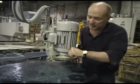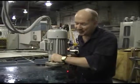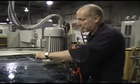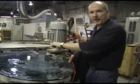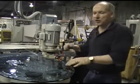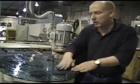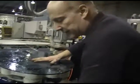And this is the second time around coming up soon. I'm just going to ease off the glass to get a smooth transition right about here. I'm going to just shut my water off, turn my table off, and my spindle. Normally I'll take the suction with a little squeegee to get most of the water off the glass right now, and then I will release my glass.